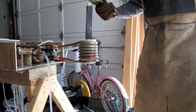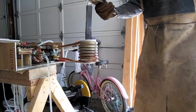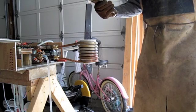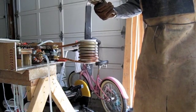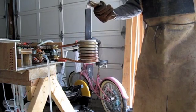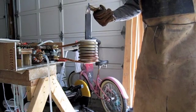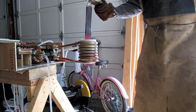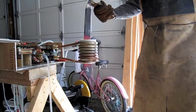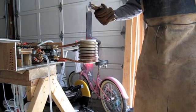Even in fairly diffuse sunlight, a section of the steel about two-thirds of the way down is already a light cherry red. It's heating up approximately two inches in length at a time. It's already gone through its cherry point. By moving the blank up and down, I've now got a section of about three and a half to four inches, certainly hotter than anything I'd need to routinely flatten and bend the steel.